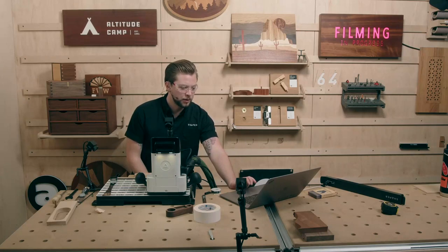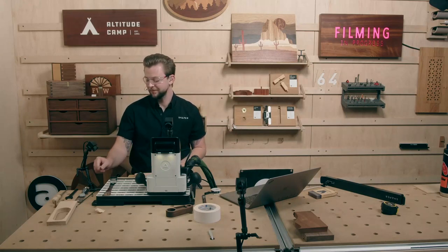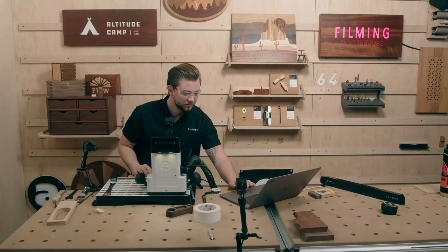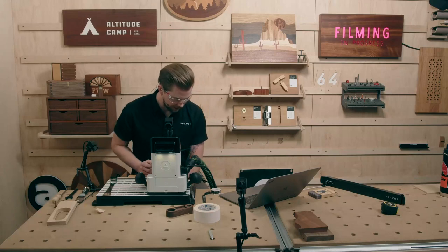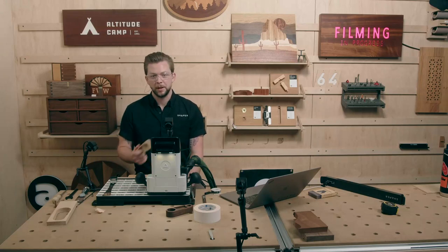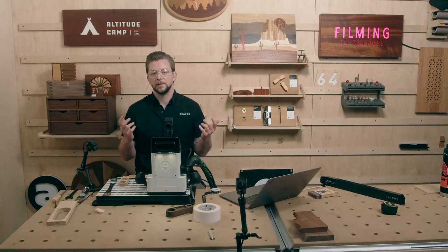All right, step 24 through 26, we've got sanding, finishing, and enjoying. Let's see what kind of finish he recommends using. Avoid pools of oil gathering in the harder to reach areas. That's a good tip. Because it is a candle holder, I'd probably stay on the more natural side and stay away from something too flammable. So a mineral oil, things like that, are going to be safe. But yeah, after I sand this up, put a coat of oil on it, good to go. Great way to turn scraps into gifts.